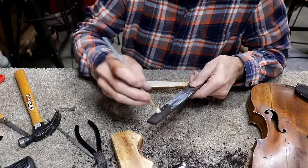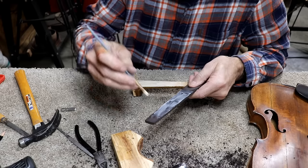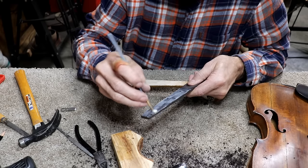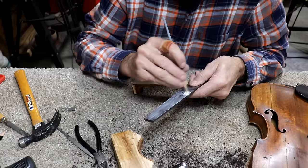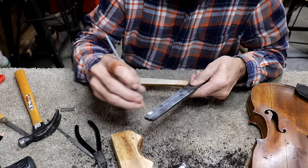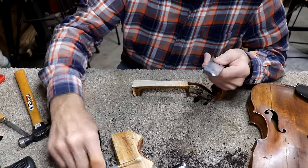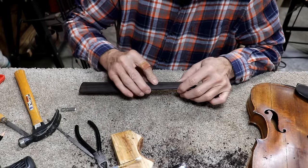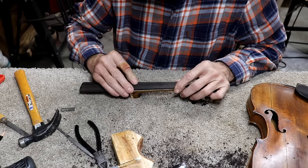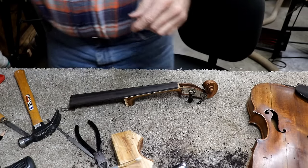The thinner you can make this and 100% coverage, the better. It'll be stronger, it won't slide around as much. There's just lots of advantages. But you just don't want a ton of squeeze out on something like this, because it just makes it hard to maintain its position. It wants to slide all the time. But with the two little nails, if you put those in there and you do it properly, then it'll stay anyway. I think we've got that.